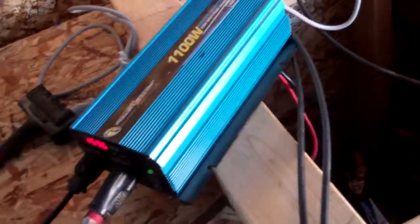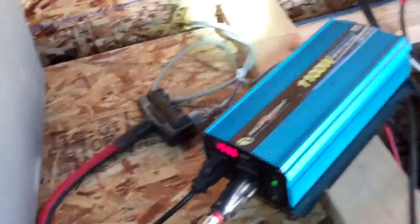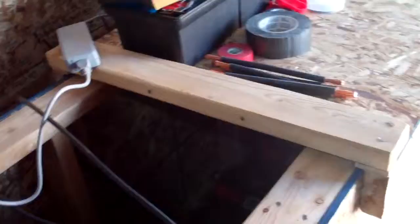I do have more batteries down there — seven in total. Whenever I had these LED lights on and plugged in the modem, it took down the LED lights immediately. As soon as the modem got done charging up the LED lights came back on. But then I plugged in my laptop — the lights went down and the whole modem went down until the laptop had enough to boot. Then the modem came back up and the LED lights came back up. Obviously that can't happen in the real system.